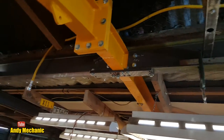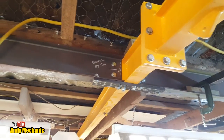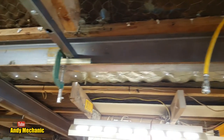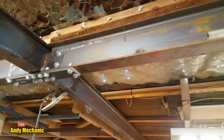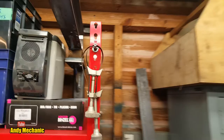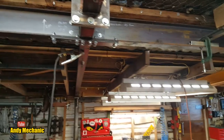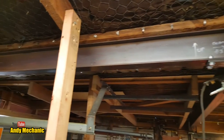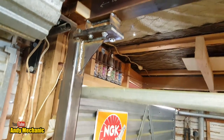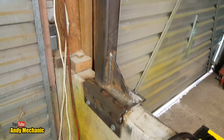And then this Christmas holidays, God, it's taken me ages. I have managed to fit this longitudinal beam, which is number three, and this transverse beam, which is transverse beam number 3, obviously with a leg onto the concrete, same as all the rest, and fit longitudinal beam number 4 with a temporary, although it doesn't look very temporary, does it? Temporary supporting leg.